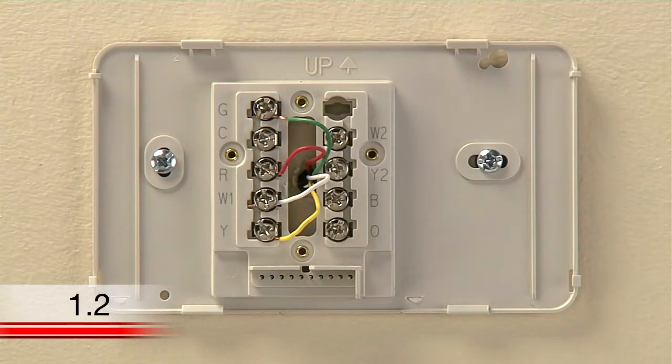This video will help you install your thermostat if you do not have a wire labeled C, but you do have a gas, oil, or propane conventional forced air system and a wire labeled G. If you use this option, the G wire will be substituted for your C wire at both your thermostat and heating and cooling system, which will remove your ability to turn your system fan on. However, the fan will still run when your system runs. Please refer to your local building code before using this wiring option.